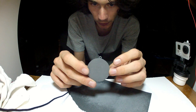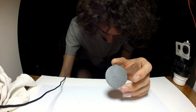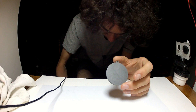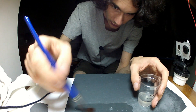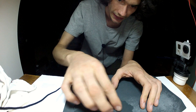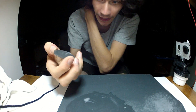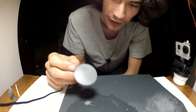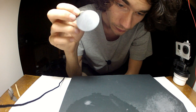Metal particles are really starting to show, so it's time to jump to the 500 grit. When I jump to 500, I also like to bust out some soapy water. The reason is because the higher the grit, the more likely it is to get clogged up. So I take some soapy water — I'm just using a paintbrush so I don't make a mess — and apply it down there. Just a drop of soap in a bit of water, it doesn't take much. We're just trying to cut the surface tension and lubricate a little bit so the part slides smoothly. Sand a little bit with this, then grab a little rag to wipe it off. Hopefully you can tell this is starting to get more shine going on and you can't see any of the imperfections anymore.